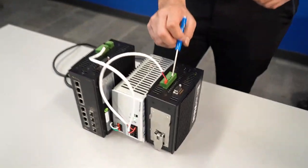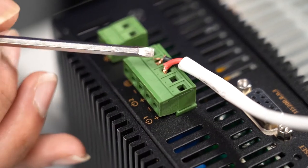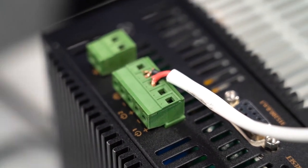I did one with the ferrules and without the ferrules just so you can see the difference. This one, as you can see, is done with the ferrules — all clean termination. And this one without the ferrules has some flares; some parts are flaring out.